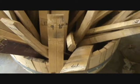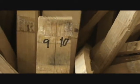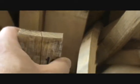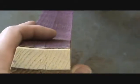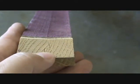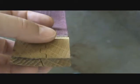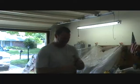These American barrels that I'm using have some really thin staves, which makes it kind of hard to take them apart and put them back together. But what you'll find on some of these is that they're a tongue and groove construction. So what you have to do is take off just enough where you can still use that. So we're going to take this down to about there and put it back together.